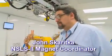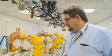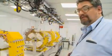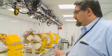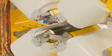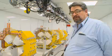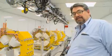Today we're basically finishing or culminating almost four years worth of research and engineering design in the development of the magnet girder assembly for NSLS-2. NSLS-2, unlike almost any of the accelerators built in the world today, have extremely tight real alignment tolerances that must be met. That is the magnetic alignment — the magnetic fields centered inside these magnets must be coaxial or exist on a common axis within about 30 microns or better. And in the last four years since the inception of the NSLS-2 project, this has been probably one of the critical design issues for the project.